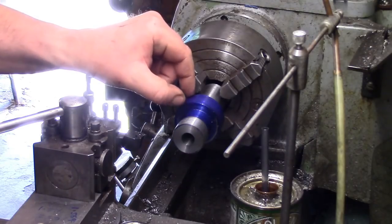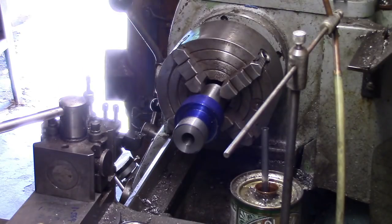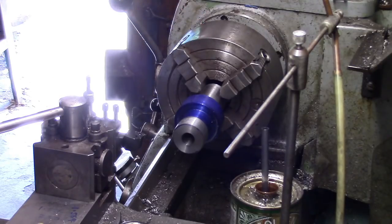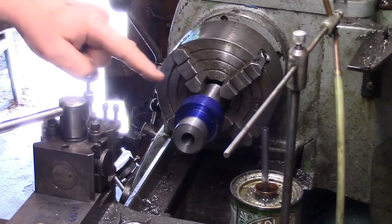So we've got a bit of an edge there to break off. The threading, I'm quite happy with that. So what I'm going to have to do now is take this chuck off. Luckily it's centre mark, so it can go back on in the same spot. I'm going to have to put the three jaw on, put a piece of bar in there and machine it